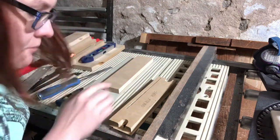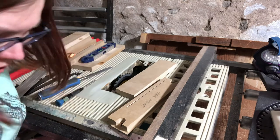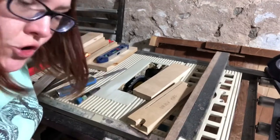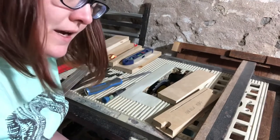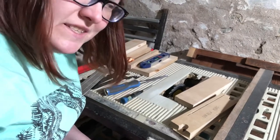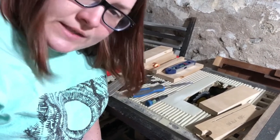Whenever you're messing about with your saw, you obviously should have it off, but make sure it's unplugged too. It would just be awful if I bumped the on switch with my knee when my hand was in there. No. Unplug your saw whenever you're changing your blade or doing anything at all other than being about ready to use it. Don't even plug it in until you have your goggles and stuff on, your eye protection, your hearing protection. Just make it your last step. And your first step after you're done with your series of cuts is unplug it.